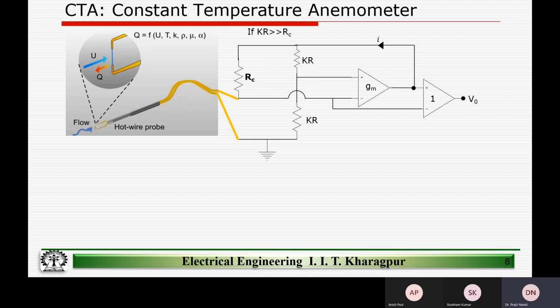And going to the point that Shubham is raising, that what if the values are way off, right? You will see that even when we are designing integrated circuits, where there will be local feedback and everything will be inside the chip, forget the sensor, where this guy is sitting outside, even there, if you choose element values which are far from each other, you may not even be able to stabilize the circuit, in the sense that either it will saturate or it will keep oscillating.